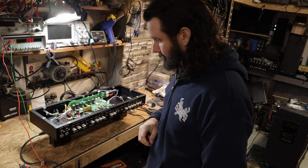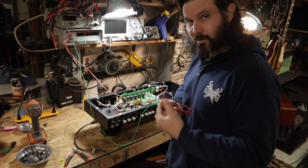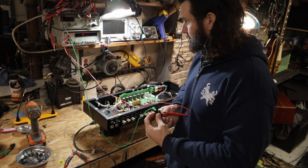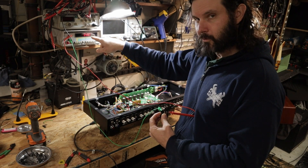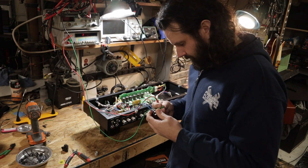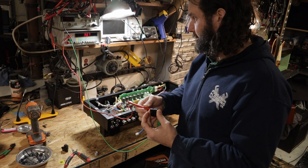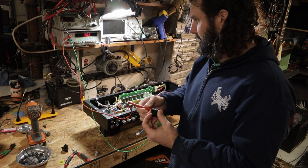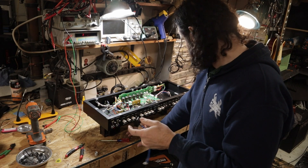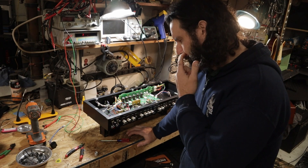So we've got a whole host of things going on with this. The continuity on that switch is not very good. I've got a similar switch — this is a rocker that would go in a Marshall standby. When I close this switch, I've got zero ohms, which is what you want. But that's the switch that was in there, and the continuity on those contacts is fluctuating around 30 ohms. So the contacts within the switch are dirty. A Marshall style switch will not fit. I don't know that that's a feature even worth keeping, to be honest.